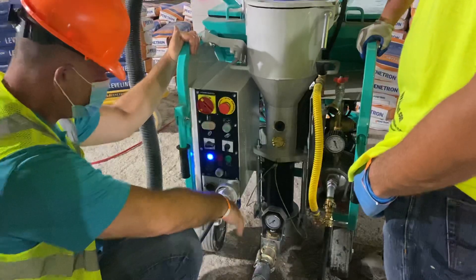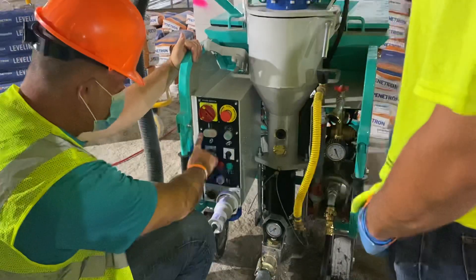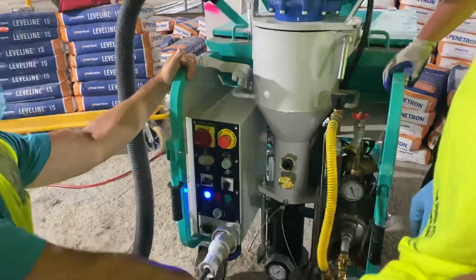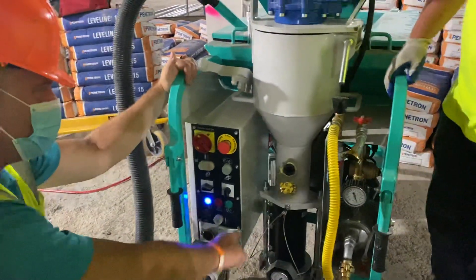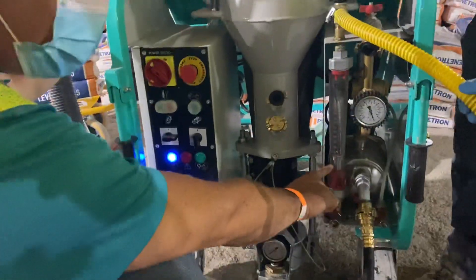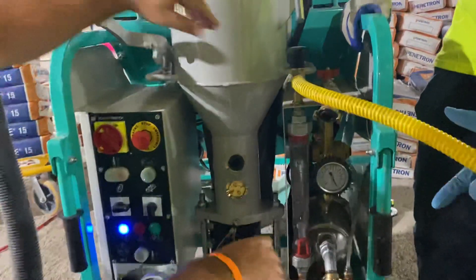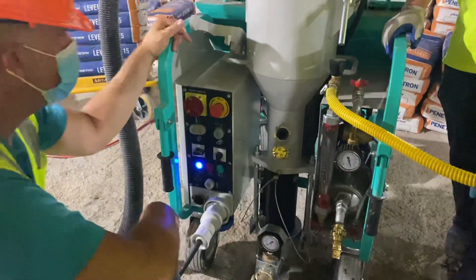This is going to run the water — when you turn this thing on, the water automatically pumps itself. The only reason you'd pump this manually is to set your level and make sure your pressure is good. To set it again: keep the machine off, hold this over a five-gallon pail, press this button, and this gauge will come up to show where you are. Adjust it up or down to where you want to be. Right now at 1200 it's fine — you don't need to adjust unless you change material.